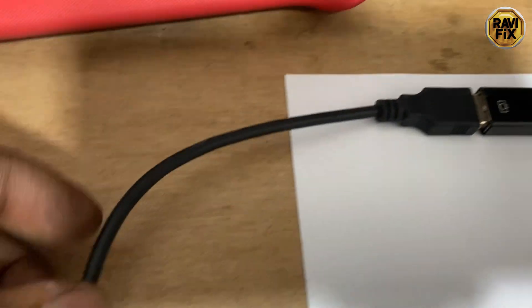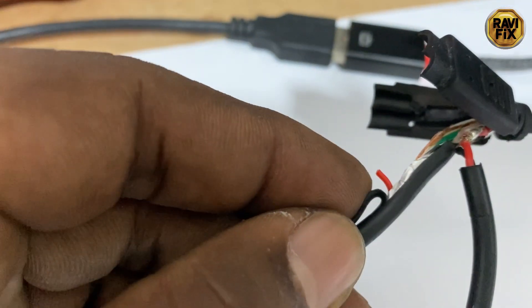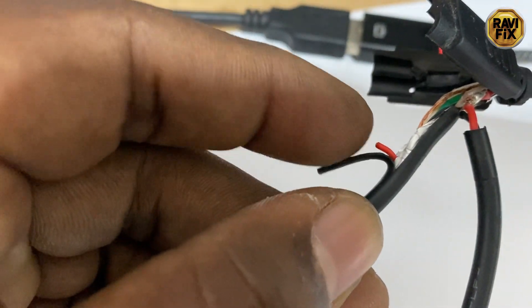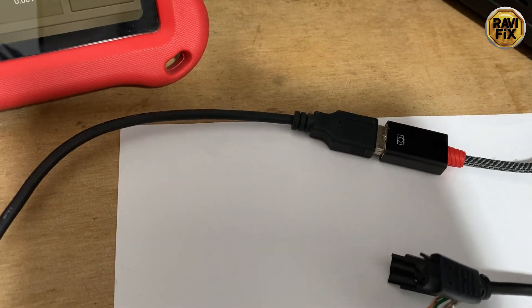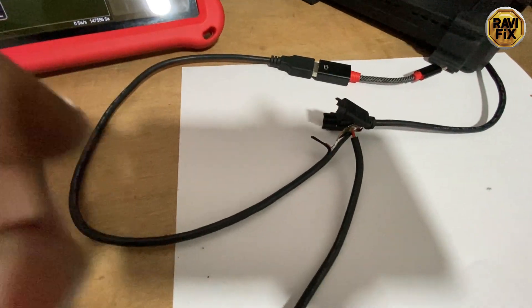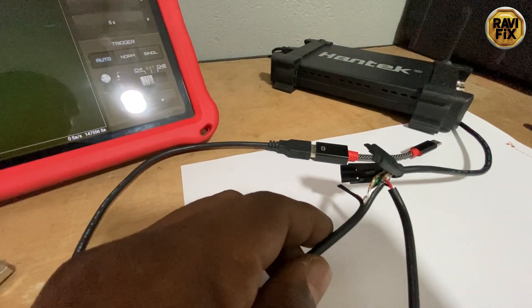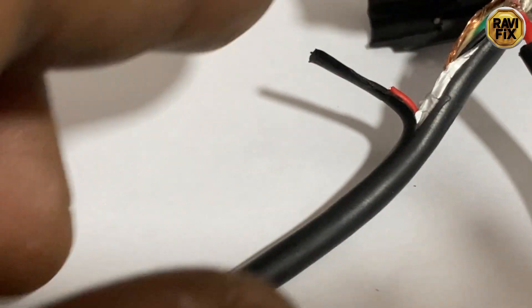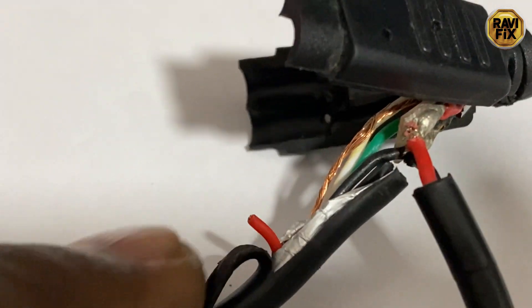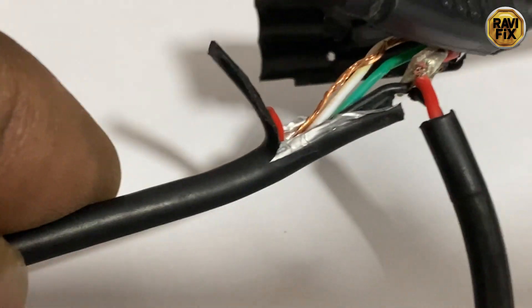Let's take a closer look. You can see this is the tablet-connected cable. I just cut off the red wire that goes to the tablet side — this is the cut wire. Keep in mind the red and black wires are the power positive and negative for the USB connection. The purpose of cutting that red wire from the tablet side is to stop the power feed to the tablet and stop drawing current from it. That means the tablet will no longer charge or drain its power through this Y-cable. Do not cut or damage any other wires — just keep them as they are. After cutting that red wire, the charging cable of this Y-cable now provides power only to the oscilloscope, not to the host device.